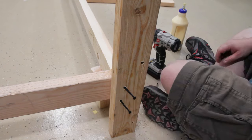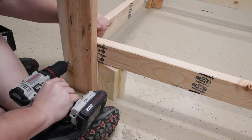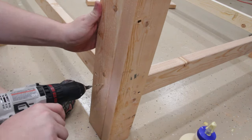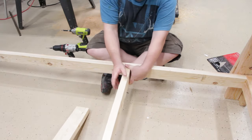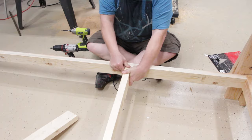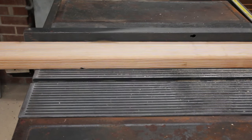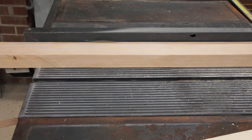Attaching the legs, I didn't really care about the drill holes being perfectly square — it's just an assembly table. When I applied the glue it was a little messy, and again, gluing things up like this was a mistake. I'm using three-inch drywall screws; if I needed more strength I'd use actual construction screws, but these work fine for this. You'll also see my beagle mix dog named Bowie throughout the video — he's been a joy since we rescued him, though he's destroyed about four or five hundred dollars worth of stuff.